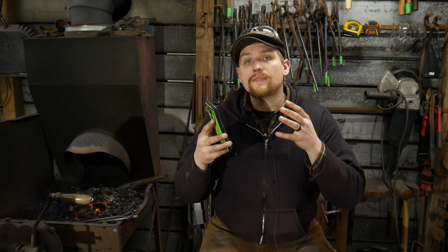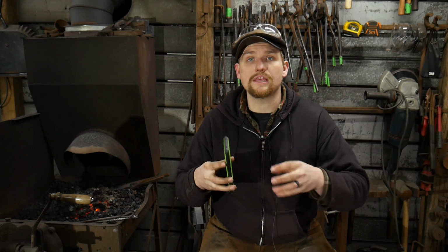That is something that I didn't go real deep into as I was trying to highlight the myth of clinkers preventing you from welding. The myth is that the clinkers blow up against your metal, somehow get into your joint, and prevent you from making a good forge weld. My counter argument was that it's the oxygen in the firebox, in the fire pot, that is actually creating the problem with you being able to get welds to stick, and too much flux. So that was the main purpose of that video, but he is 100% correct on that.